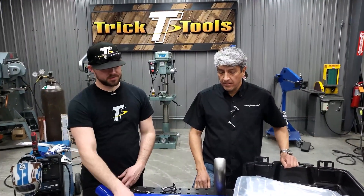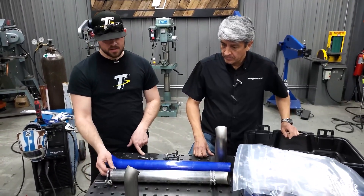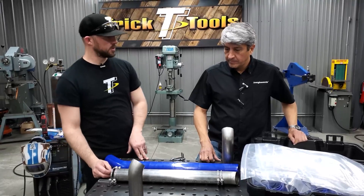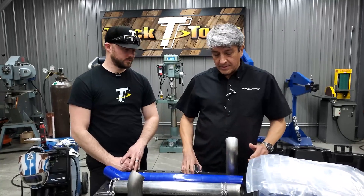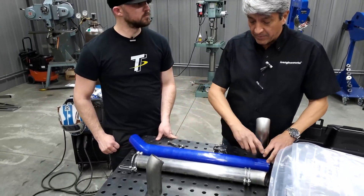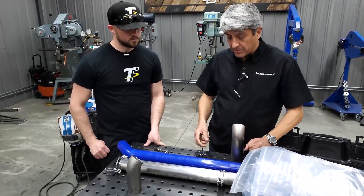We got the parts cut here to match the modeling blocks we had mocked up. We have a couple of tack weld clamps in place, ready to help us fit everything into the chassis. Victor, if you'd give us a little explanation on how the tack weld clamps work and a demonstration as well. The whole idea with the clamps is to be able to hold more than two sections at once — more than you can hold in each hand — and ideally prepare the entire assembly in one piece so you can present it and make minor tweaks.